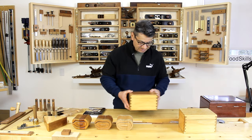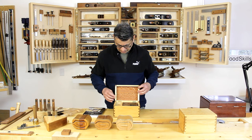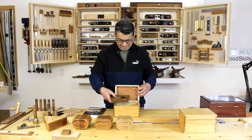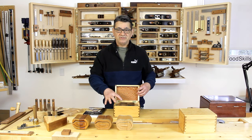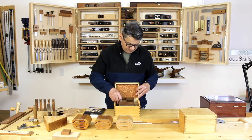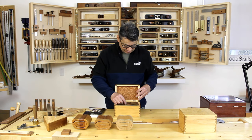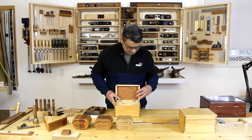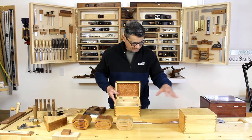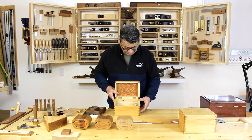I then progressed to more conventional boxes. Here are some music boxes I created using an assortment of exotic woods. They're fairly straightforward with a chain to hold the lid open and a single drawer, fabricated with very little joinery - just a rabbeted bottom. The inside has a second layer at the very bottom with a tray. There's a music box component to this, but I won't fire it up as it'll overtake the whole talk. I have three of these left over from about 30 years ago.